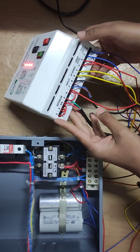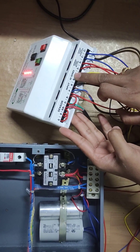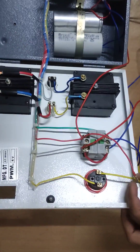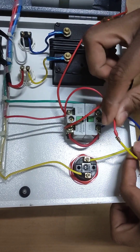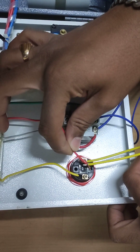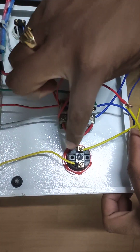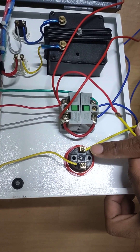Now another is NV series. NV series — the work is for motor stop. So these two yellow wires we need to connect to the device and go to starter stop button. In starter stop button we need to make series connection. So we need to remove here and connect direct to N wire, and V wire need to connect here in stop button. So it's a simple NV series connection.